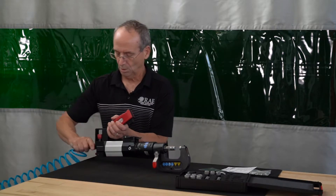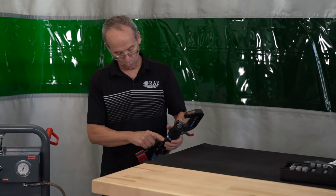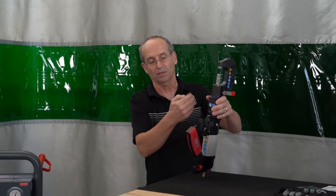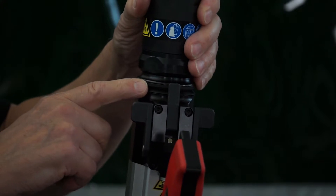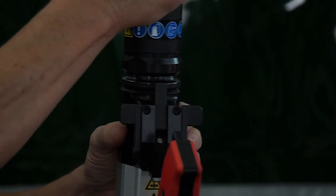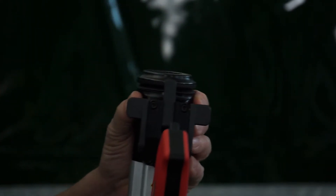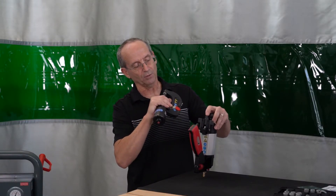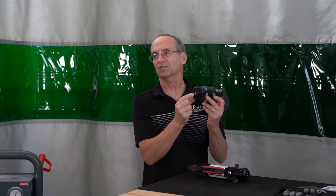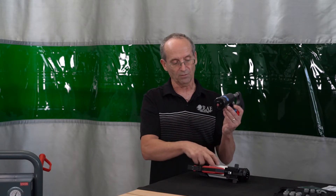So when we go to load the head assembly or take the head assembly off on the gun, this is a newer style collar. For you guys that are not familiar with it, the older style had a lever on the back that you would turn and the head assembly would come off. This acts more like a hose coupler — we're going to pull down on this and the head assembly will come out. So we want to make sure that the lever is up. Hold the assembly before you release the ring because it is spring-loaded, and we're just going to pull down on that and the head assembly will come out. If you don't keep this lever up, it's not going to happen every time, but eventually you have a very good chance of blowing out the seal in the bottom of the cylinder. This is part of relieving pressure on either side of the pump or the cylinder.